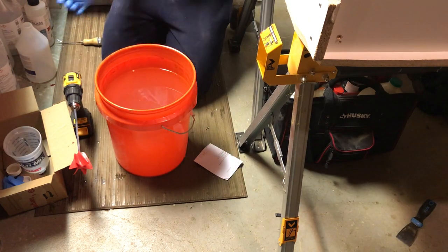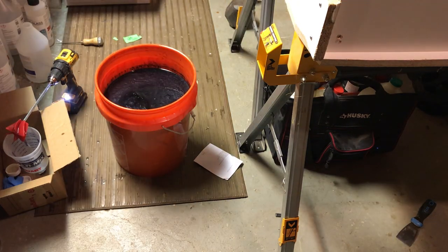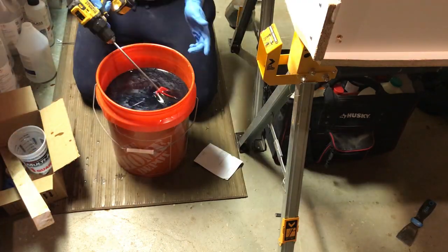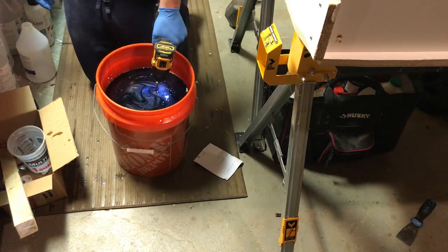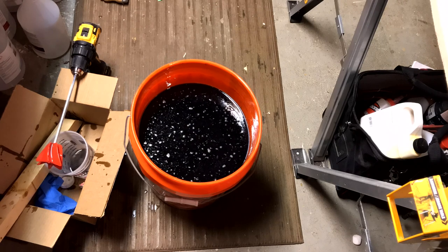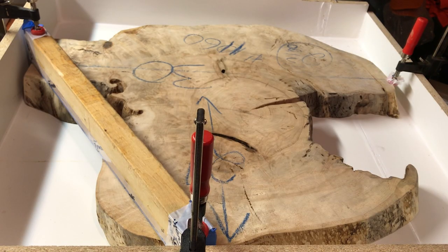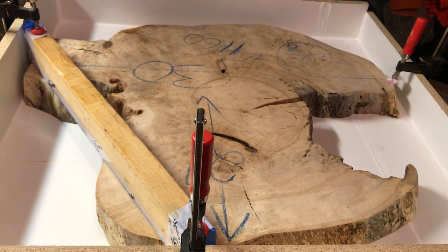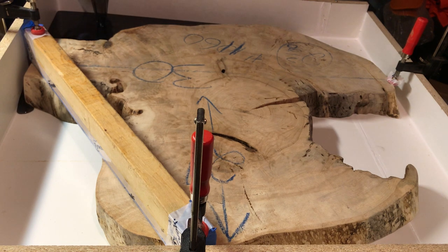I always use the powder black pigment — that way I don't have to seal my slabs. This powder does not stain and it hasn't stained on any of my projects, so I prefer it over the drops. One thing I really try to avoid is not mixing the epoxy enough. I'm at this bucket for like 20 minutes using the drill bit and stir stick, then I let the epoxy sit for a couple minutes to bring the bubbles to the top. I've got it clamped down so the slab doesn't float. I ended up not having quite enough epoxy — if I'd just cut off those corners I think it would have been fine — so I got about two inches and then had to come back later to top it off.